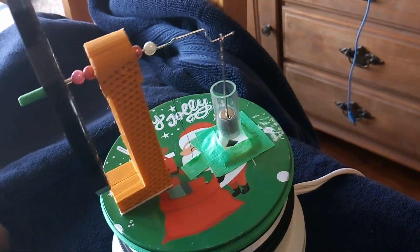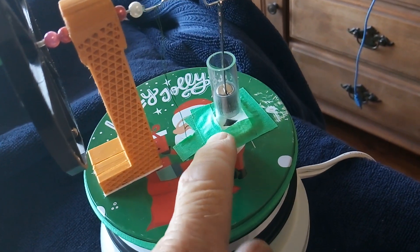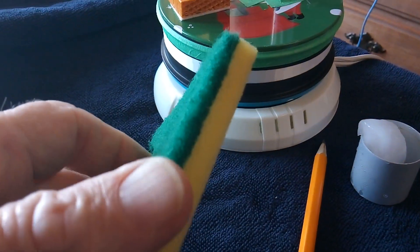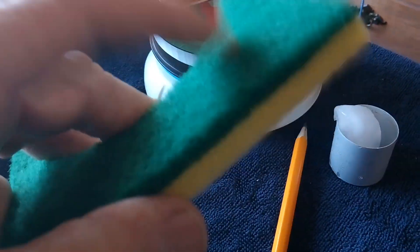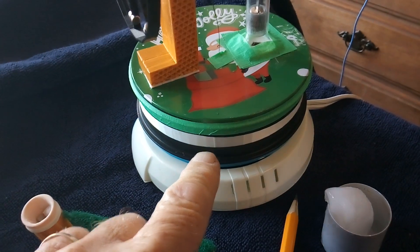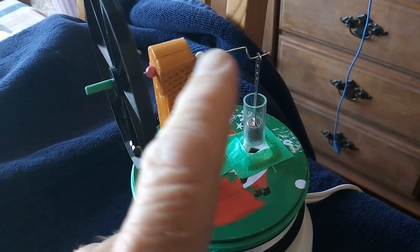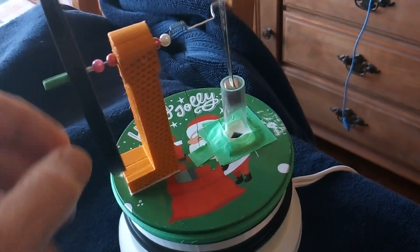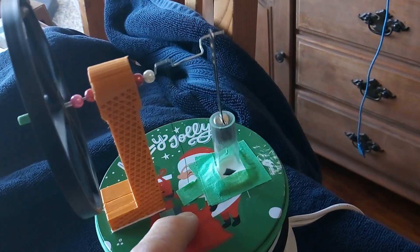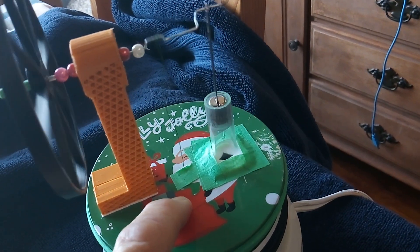This really made a big difference. I just got it stuck on there with double-sided sticky tape and some tape. The displacer is this foam sponge with that part facing up — it acts like a regenerator. The spacer in here is PLA printed; it's a Christmas cookie tin. And then these other parts are PLA. It ended up making a much, much better Stirling engine using that store-bought power piston.